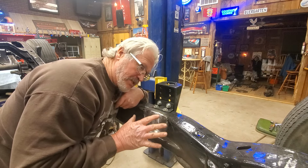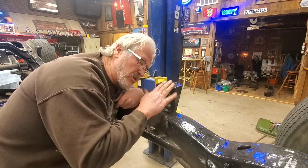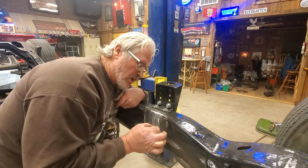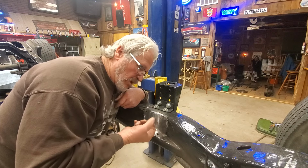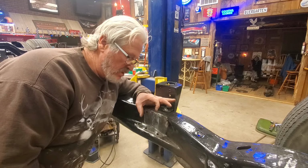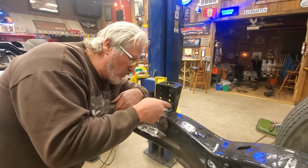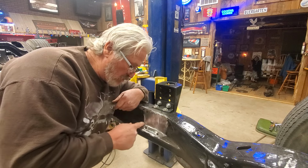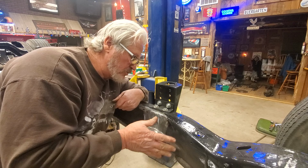I personally think that this method is the quickest and easiest method to mount these mounts, because you cut that window out, you can really reach in there. You know, when I talked to Russ D, he said he uses a 2-inch hole saw. And I mean, a 2-inch hole saw is pretty good size, but still you got to try to get your fingers in there and reach all the way to the other side of the frame and try to get them nuts on there and the washers and all that. Cutting this window in it like that made it real easy to get to, real simple.